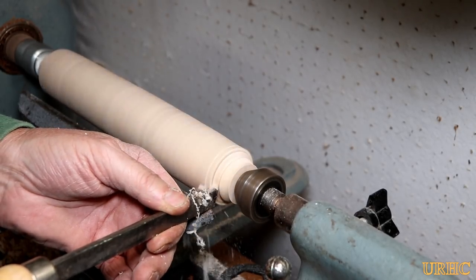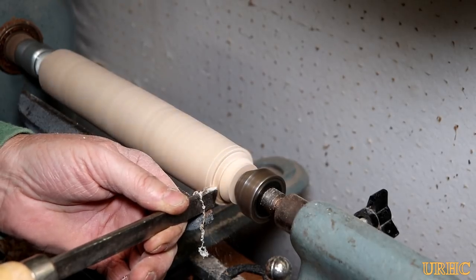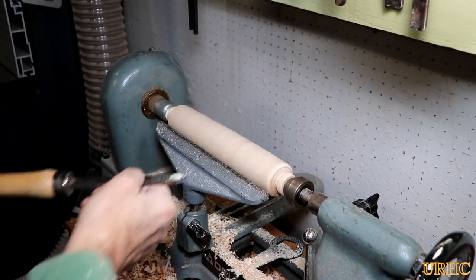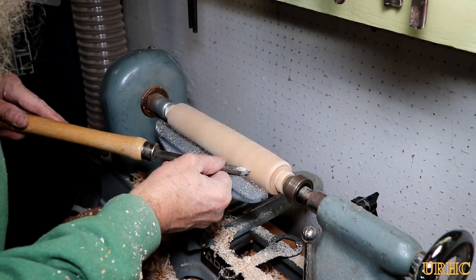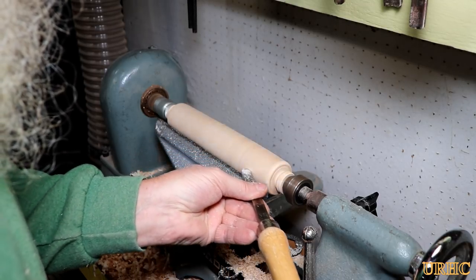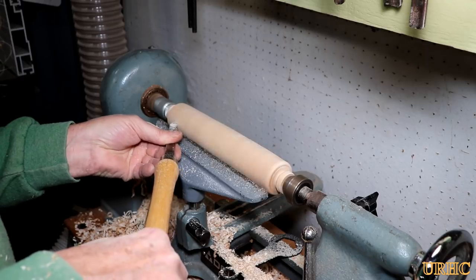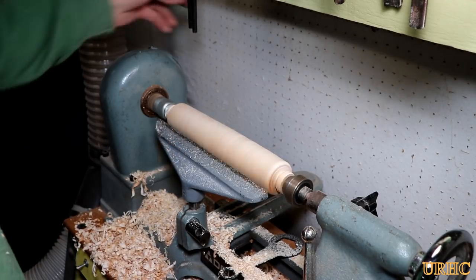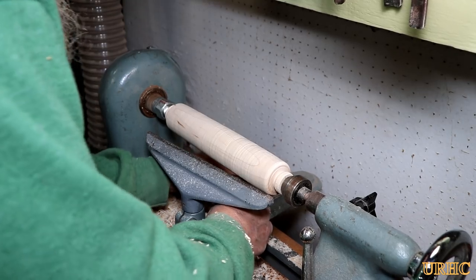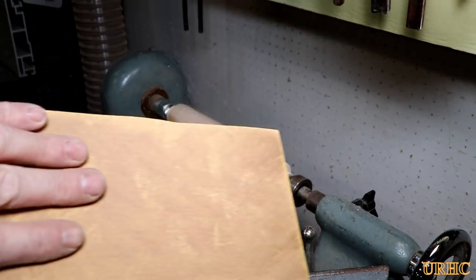There you can see what I mean by my lathe belt actually slipping if you catch — it can be a pain at times, but that's really the way this lathe was made to work. Just a couple more minutes here cleaning up the ends. Then I get this tool acting more like a scraping tool than a cutting tool, and just make a couple of light passes to try to get any tear out off before going to the next step of sanding. The shape is pretty much roughed out to what I want it to be, and now it's time to go on to the sanding step. You want it to look pretty clean without much tear out before you start sanding.